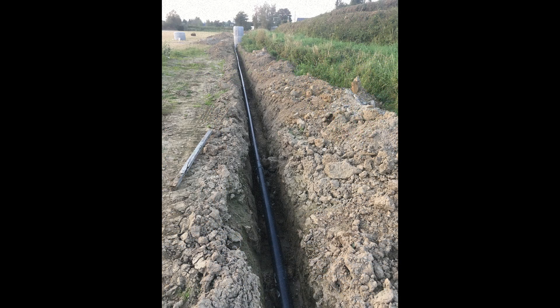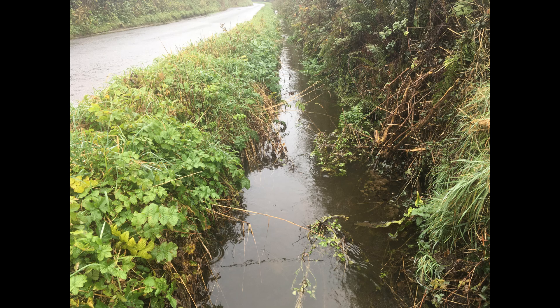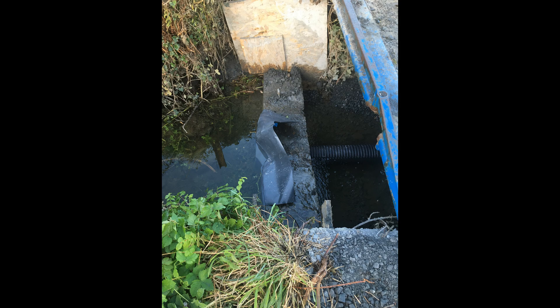While the first stages of our tank and chamber were in place and drying, we moved on and excavated further upstream to where the trench met with the existing stream or river. In this section, we had to allow the supply pipe to cross beneath an existing river bed. Here we see the river supply source and a concrete mini-dam or supply head, which is secured deeply into the river bed. The supply pipe is secured into concrete and has a shutoff sluice fitted.